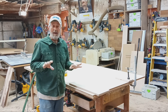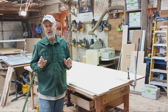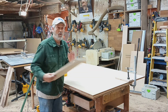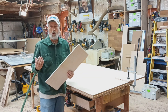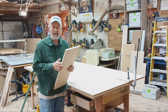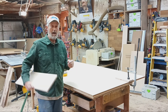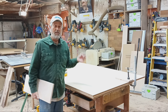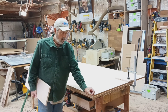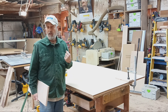It's going to be really important to glue it up on a flat surface, but there's one other important thing I want to share in this video: when you're trying to get a really good joint between two pieces of plywood you have to have a really good clean edge. For this door I'm making saw kerfs with a track saw about every four inches, so I'm laying out the joint right on one of those saw kerfs, but I still need to get a really good close flat joint.